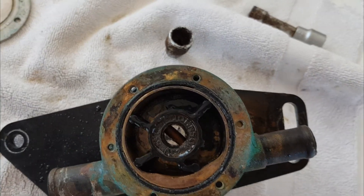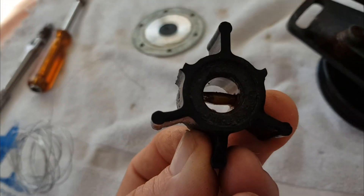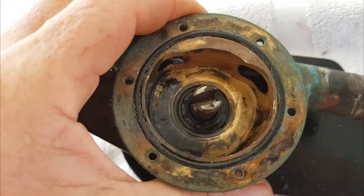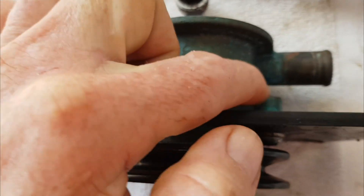We can see inside there — that's the pump without the impeller, and there's the impeller with broken blades. You can see the plate's broken off. The next point is that seal there — we have to take that out and the water leaks through over there.